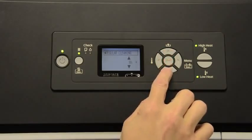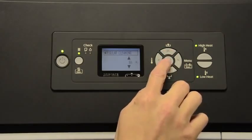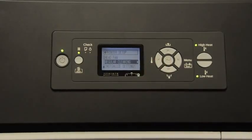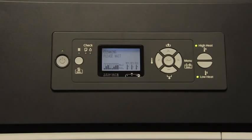It is recommended that if your GS6000 is not in full production use, the regular cleaning cycle should be set to a short duration, where if the GS6000 is in a high production environment, it is possible to turn the regular cleaning cycle to a higher interval so the GS6000 does not clean as much.